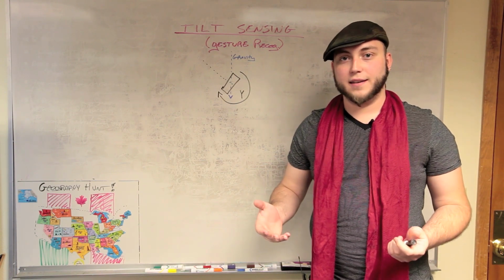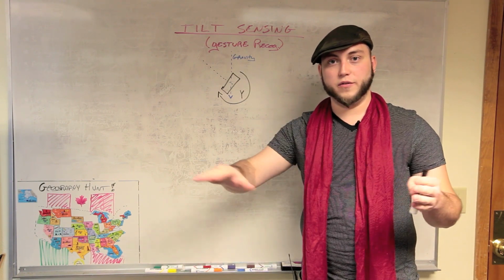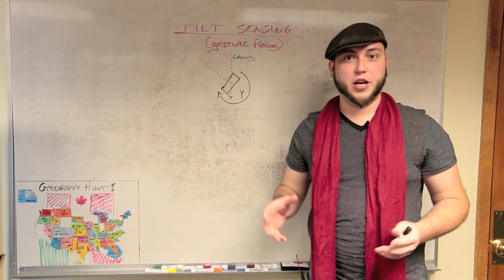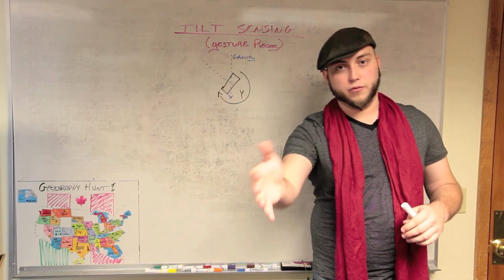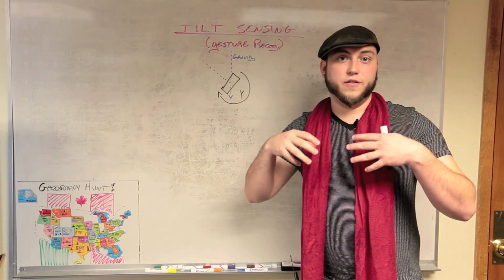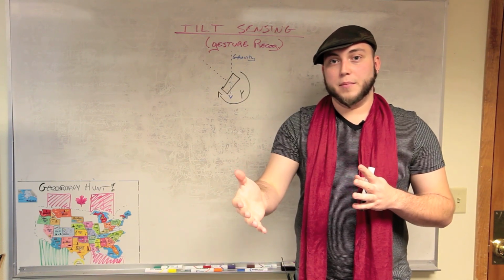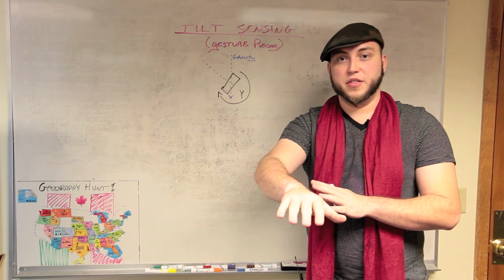True gesture recognition can tell between two really similar sort of gestures because it takes this huge store of data and compares it using something called dynamic time warping to find the best fit out of a catalog of gestures. If all you're trying to tell the difference between is a move like the ones that I'm doing where you're rotating your wrist one way or another or up and down, that's easy to do. Instead of trying to find the acceleration of the gesture across, you just sort of line up an array of orientations. All of the motions that I'm making are characterized by the fact that they're pretty extreme from the equilibrium of the sensors.